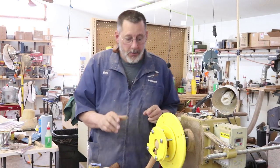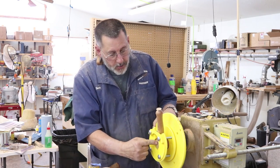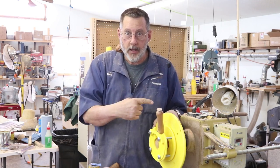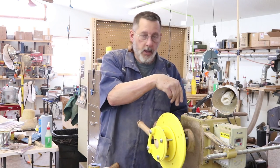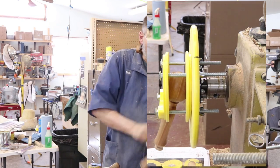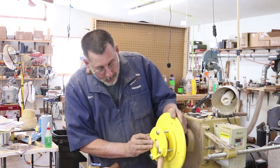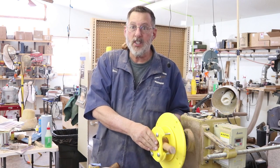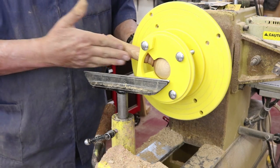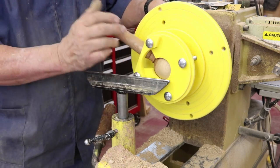The ladle is just a spindle turning, and this part here is really a ball or a sphere. This was too long for my smaller lathe, and I've got a little clip showing how I fixed this onto my inch-and-a-quarter spindle — I've got an adapter on there, this just wouldn't clear the bedways. Let me get my tool rest up here and we'll finish off the inside of this ladle. You may notice that I've got my ladle handle angled a little bit — that'll place the opening in a different spot and it'll look more like a ladle.